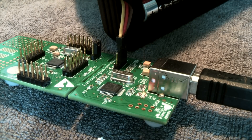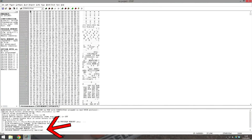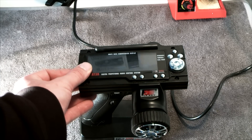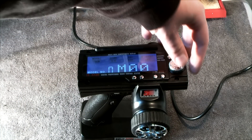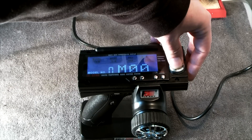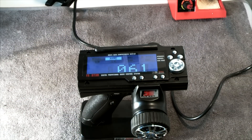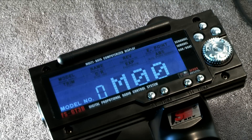You will see the progress on the screen. Your GT3B will beep and a red LED will start flashing. After successfully completing the installation process, the red LED stays on and you will get this message on the screen. You can now disconnect your transmitter from the STM8S. To check if the installation was successful, turn on your transmitter and press the menu button until this screen is shown. This confirms the successful installation of software version 6.1.